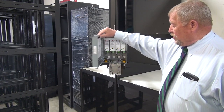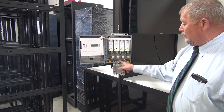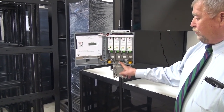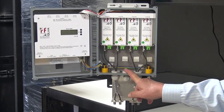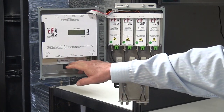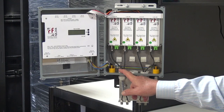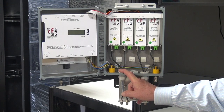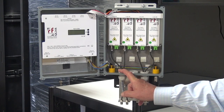It's got a fiber optic input connection here in the center, which feeds your half-inch fiber optic cable in. We supply with the enclosure field-installable FC-APC fiber connectors. We have a splice holder and some fiber management installed in the housing. This allows you to do a field installation without the need for a fusion splicer, though obviously a fusion splicer would be the better way to go.